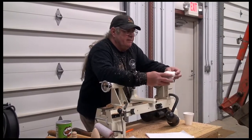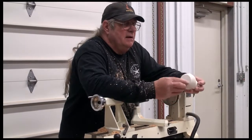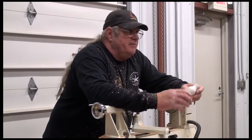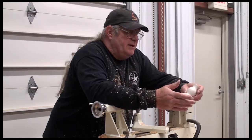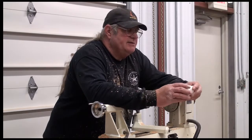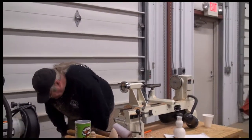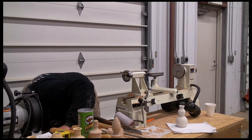You can see this pine, piece of that pallet wood joined together. It's pretty crude. It's torn out here and everything else. Because this is going to be painted, you could fill this with Bondo if you want. You're not going to see it. But because this is an antique finish, if this had wormholes in it, it's fine. This is going to be an antique finish, and hopefully we'll find a way of doing that.